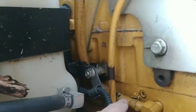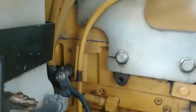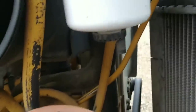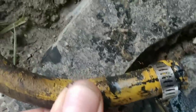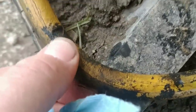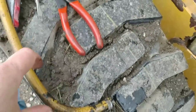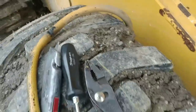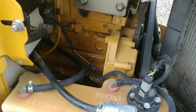I'm going to take it loose real quick, pull it out of there, and see what I can find - see if it's got some holes in it. It looks like just regular rubber fuel line for diesel fuel and it comes right up to my filter housing. This is where the dipstick was rubbing - it's not through there, but where it came through that bracket it is. When we replace this we'll put a protective sleeve over top, plus a larger piece of hose where it was rubbing, so this doesn't happen again. I'm going to head into the parts store and hopefully get some fuel line.